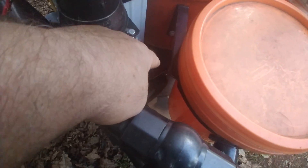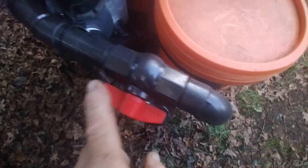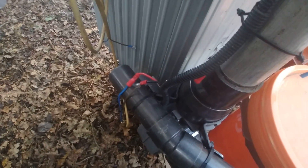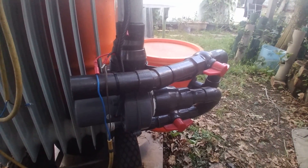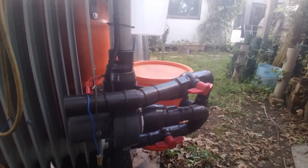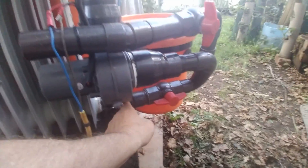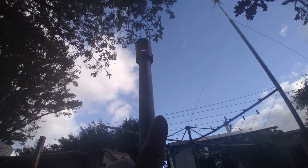There's no need to have the tap in an inaccessible place, but the moisture can still carry on into this bucket. From here the gases come along and go into a flexible pipe that will take it to the generator, the chipper, the mower — whatever internal combustion engine up to 30 horsepower I'm using this to fuel. But to ensure we've got a pure combustible gas before passing it to the motor, the most important thing is to check the status of the gas — and that's most easily done by turning on the flare. During the warm-up phase, one tap is open and the other is closed, bringing air through the electric 12-volt fan and up the tube to the flare pipe.